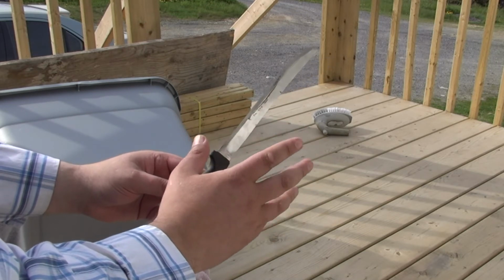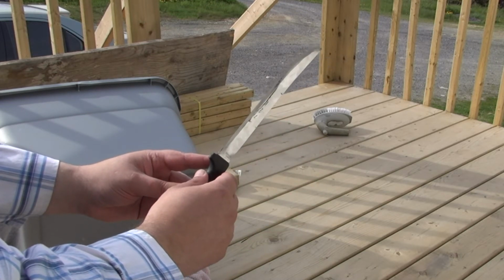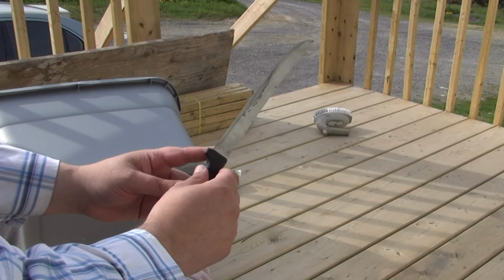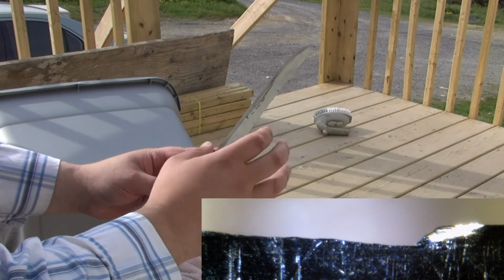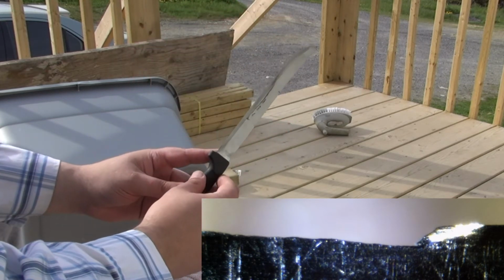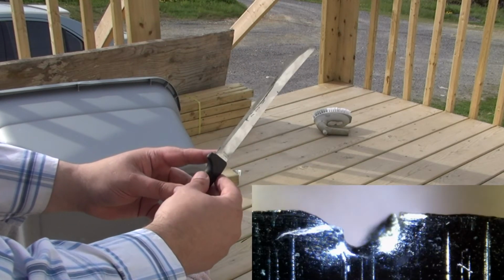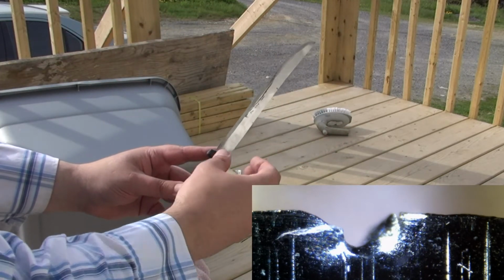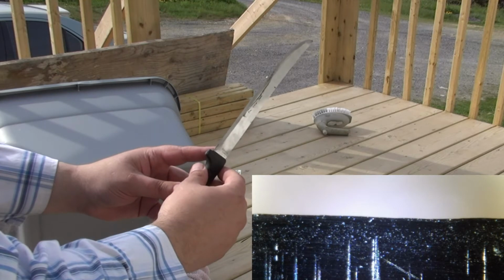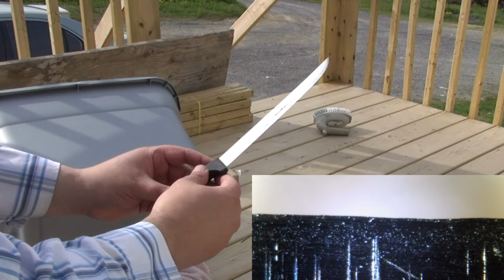Which isn't tremendously bad. It's not the lowest performance I've seen. But what was happening was that the steel was fracturing, and that fracturing was giving it a very coarse saw type effect, which it maintained until it fractured so much that it had thickened to the point where it was stable enough and then just wore smooth.